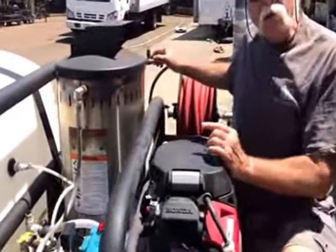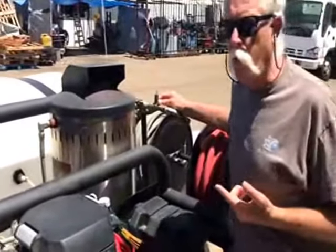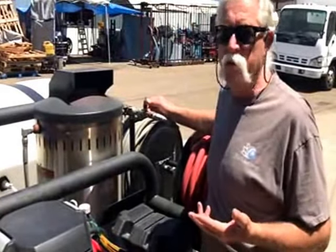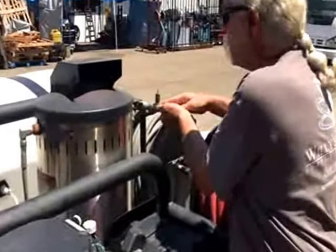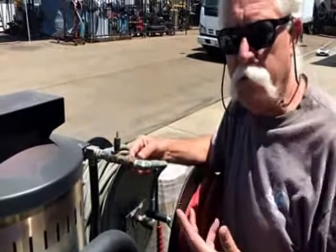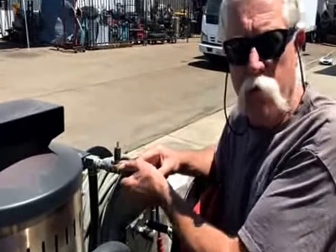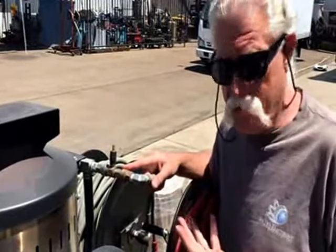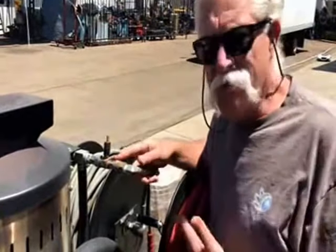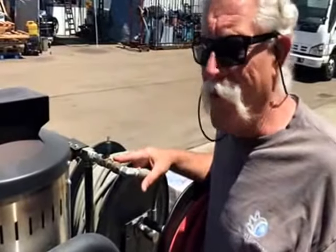This has a downstream chemical injector at the outlet of the heater for drawing soap. If you want to waste soap through a downstream chemical injector when it should have been pre-sprayed to begin with, that's fine, but don't leave it on. I can see this one lives on here because nobody's taking it off and it's all corroded on there now. We're going to have to find a way to get this back off and train the user, because if you look down its throat, it's a little tiny flow restrictor to the performance of the system. We're already down to only four gallons a minute on this pump, and to put an additional flow restrictor on here — this guy's trying to clean sidewalks, and sidewalk production-style cleaning doesn't happen at four gallons a minute, let alone through a flow restrictor. This is a mistake.